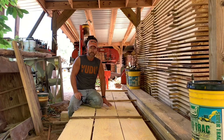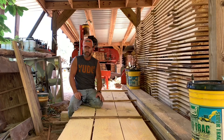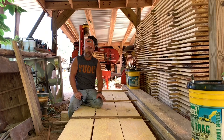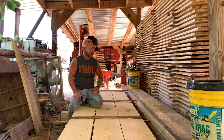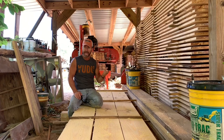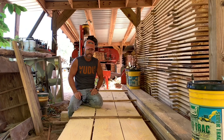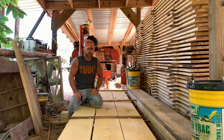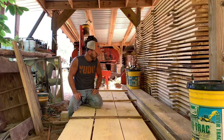A month — in these 1x12s I'll be able to use them. Yes, I build cabinets out of these things. You can get a moisture meter and actually check the moisture content in this lumber before you use it. Around here I just go about a month if the humidity's low and the temperature's high. If you've got say 10 days in a month that's humid, just add another week or two to your dry time. It's sort of a play-it-by-ear thing — you don't really know for sure what conditions are going to hold.